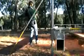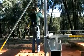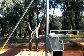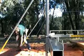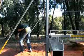When you start to get a bit of horizontal bounce, which you will occasionally when slabbing, that's where this mid-stay post comes into its own. Put the mid-stay post back in, do the wing nut up so it's tight, and that should remove all of that horizontal bounce for you.